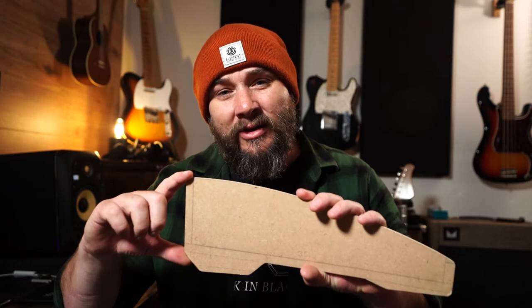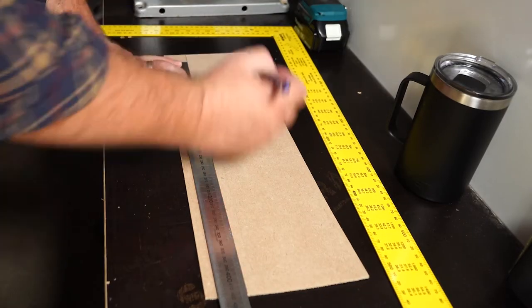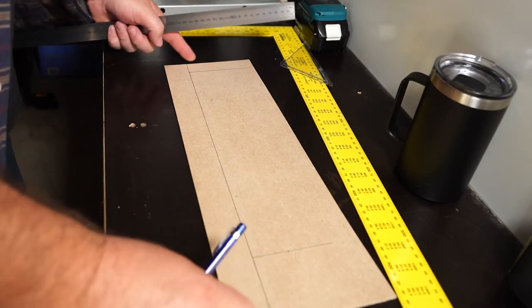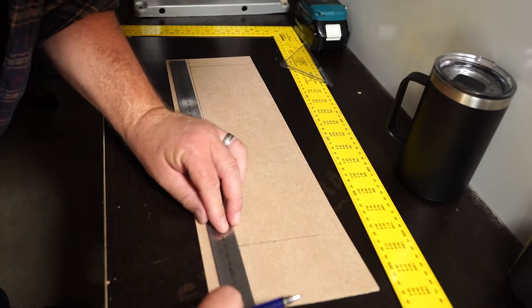What I worked out from their measurements is that the inside length is going to be 350mm, your back is going to be 110mm, and your front is going to be 40mm. To make my template, I simply grabbed a board, marked out the baseline, then my front and back, making sure the angles are totally square. Once I'd marked out the lines for my floor, front and back, I added 12mm — that's because I'm using 12mm ply. If you use a different thickness, you'll obviously have to add that thickness to the outside edges of those initial lines.